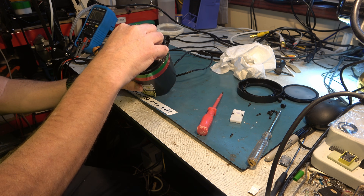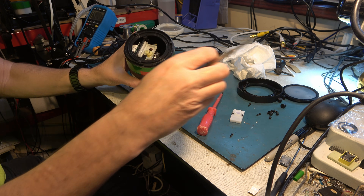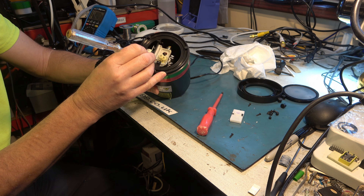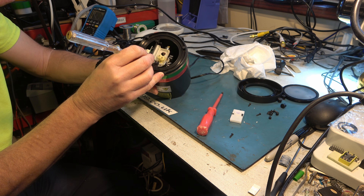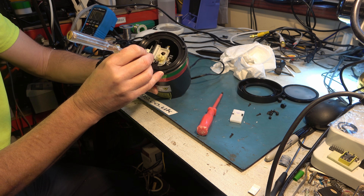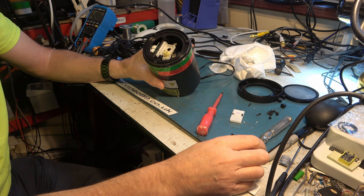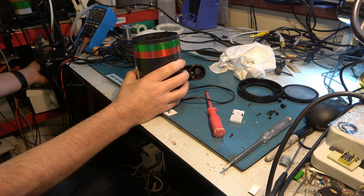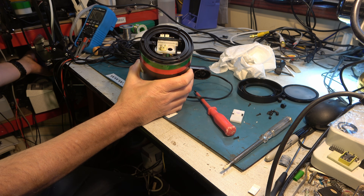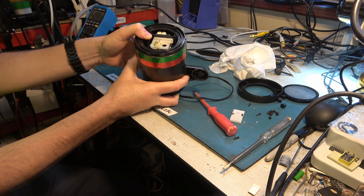Let's just try the motor. The motor is rotating, yes. There's not a fault there. Gearing down here — the rotation of the motor is much, much faster than the rotation of the final drive. I'm not seeing a fault with any of that. Let's see if I can make it operate now and we'll have a look and see if that rotates at all. I've got the lasers working, but the motor is not rotating.